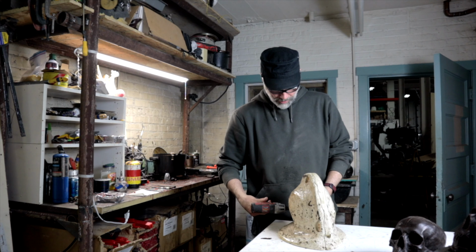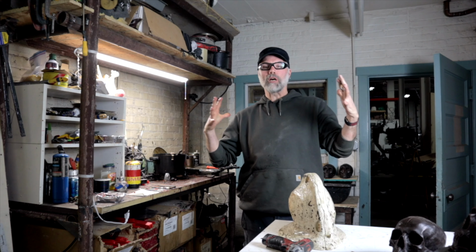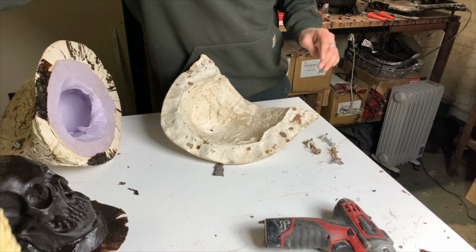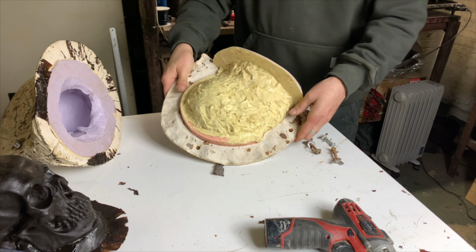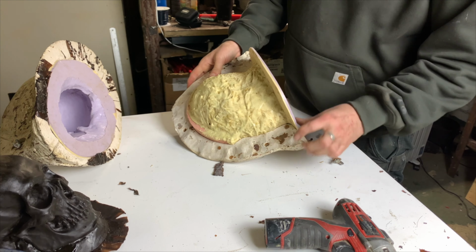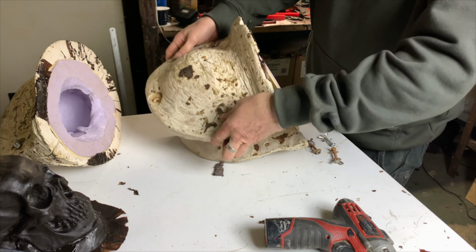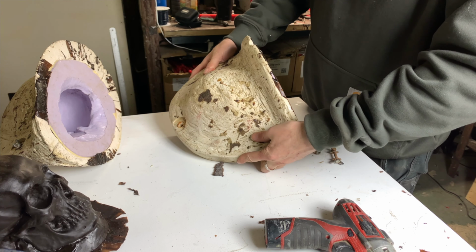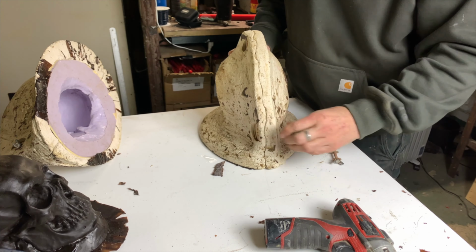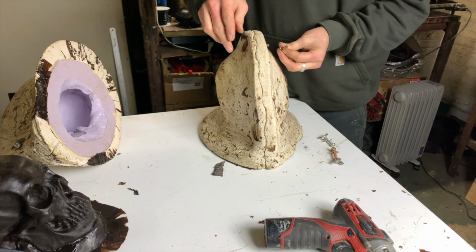I like using the screws to bind my molds together. It's just a little bit more secure, especially when molds get larger and you're rolling around trying to slush them. If they're bound together with rope or ratchet straps or rubber bands, old inner tubes, or whatever the case might be, they can either slip or snag or break, and suddenly your mold is opening up and you're getting a chest full of wax, or in my case, I've had wax getting up in my beard and whatnot. I'm going to say it's less than a pleasant experience. Doing that once or twice was enough to learn the lesson,